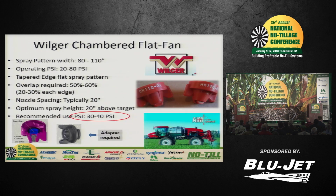Okay, this nozzle is also a chambered flat fan, but it's a special nozzle. It's not that common unless you might happen to have a Case IH, in the past, a Case IH sprayer equipped with AIM Command or pulse width technology from Capstan. And Wilger had a nozzle that fit that system very well. It still fits that system very well, though there's been some changes in the pulse market over the last 2 to 3 years. There's still a place in the market for this.